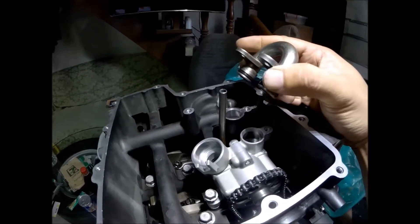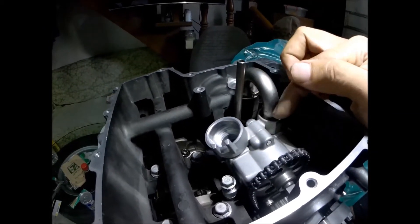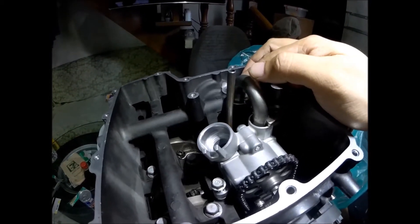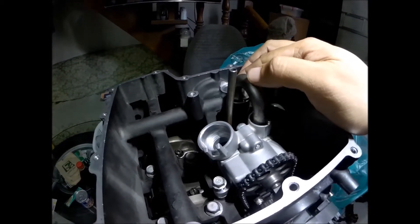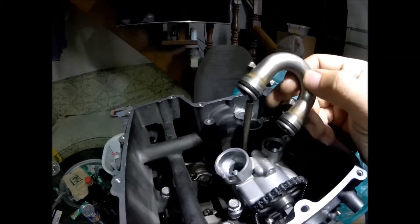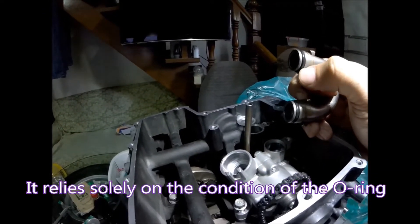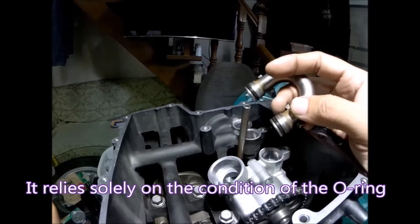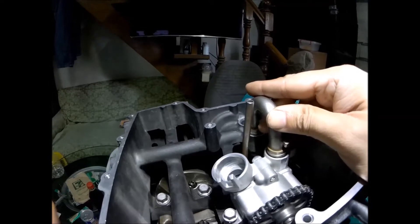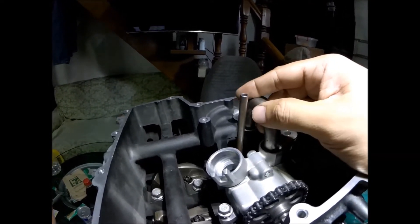This part is installed to link the oil pump towards the block, to link the oil pressure outlet towards the inlet pressure of the block. The weakness of the design is that they used O-rings, and the sealing design relies solely on the condition of the O-rings.